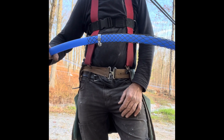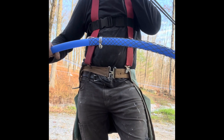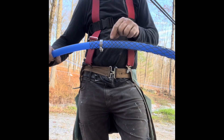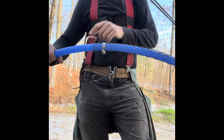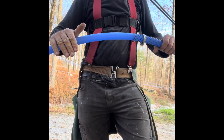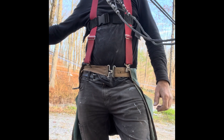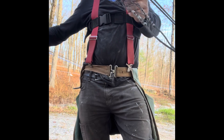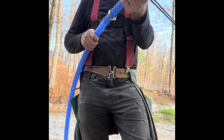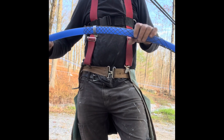So you're probably asking yourself, well, why would I do all that — buy this expensive piece — and if I still got to put a clamp on it? Well, it's insurance. Basically the clamp is insurance. Will this hold this pipe? In most cases, yes. But when you get a big hit on it with a tree and it pulls it, it'll pull it. It will stretch it out of there and it'll rip it off your fitting or whatever. So I strongly recommend this clamp, and that'll solve all that issue.